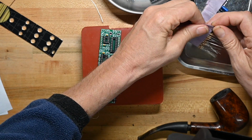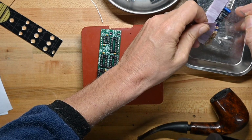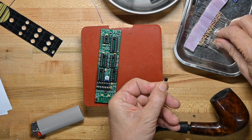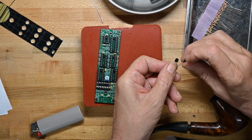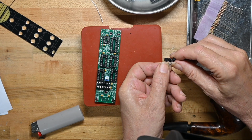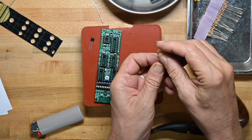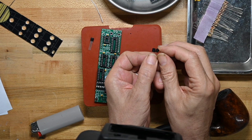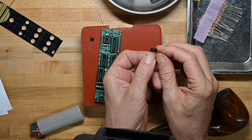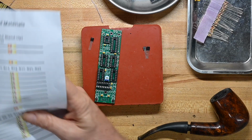So next, as I said, I'll do what I was going to do. I'm going to put the voltage regulator and the two transistors on the board. And again, they do look identical, but they are definitely not identical. Let's see what we've got here. We've got an L7805. That will be the voltage regulator to regulate to 5 volts. Then we've got a J109 and a 3906. So I don't know which one of those will go in which of the transistor spots.